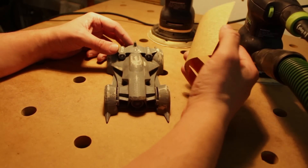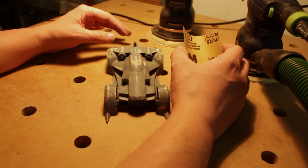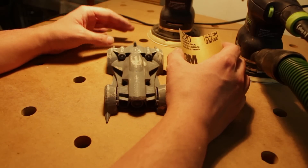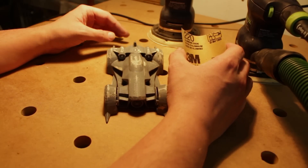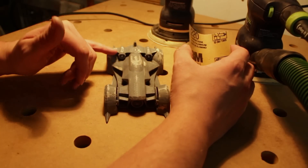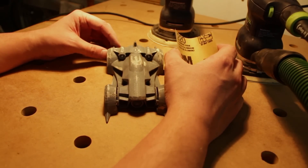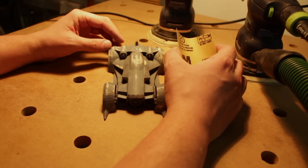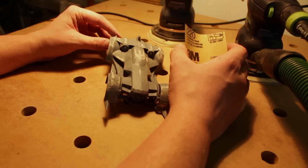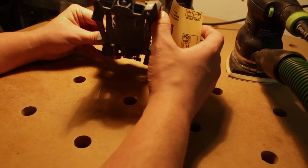Once the primer dries, you can go ahead and start sanding again. Now that we've got a coat of primer on it, we can actually see some of the areas that are going to be problematic. The main reason we wait to sand is so that we're not sanding away material that's going to come out good after the epoxy coat. Anywhere that you see imperfections and can begin to smooth them out, hit it with the sandpaper, and then we'll put another coat of primer on it — that should get rid of all the excessive striations. It is a 3D print, so we're still going to have some, but we should be able to get it cleaned up so that it does look very good by the time we're done.